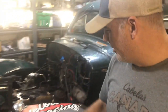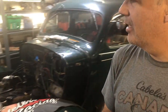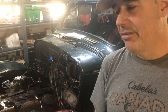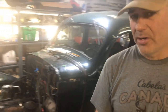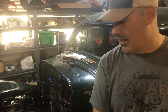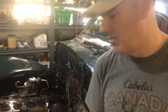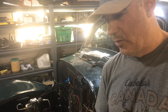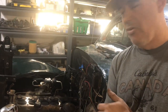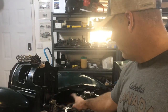I'm going to summarize the video and my findings. We learned today that with the cylinder head off, we measured the bore and the stroke: the bores appear to be very close to 3.375 inches, which is 3 and 3/8, stock bore, and the stroke is 4 and a quarter. That is bang on for the measurements for a Canadian-built 228 cubic inch engine — a 25-inch long 228 out of a 1953 Dodge. I rotated the crankshaft by hand and opened both intake and exhaust valves on all six cylinders, and I was able to verify movement at the exhaust valve on cylinders 1, 2, and 6.